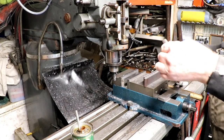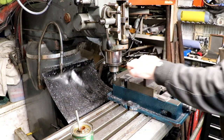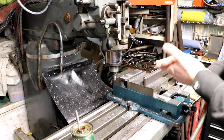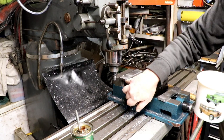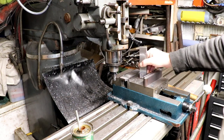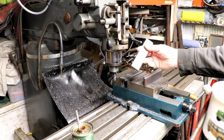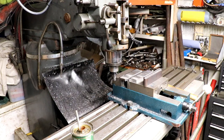These are those horrible bloody chips again, the ones you've got to be careful of. When I've got these ends cleaned up, I'm going to cut them into just over 35mm on the long pieces. We're going to have to think about drilling two holes in from the bottom that are going to bolt it to the plate. It's going to sit like that — that's going to be one of the hinges. Two bolts will go through the bottom to pull it onto the plate, and my rather crude drawing is where the dowel pin is going to go to make the hinge. I'll carry on with these and then bring you back in a bit.